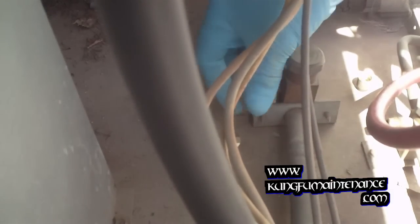Let's have a look at the low side here. Listening for any leaking there. We want to make sure — and actually I can hear the leak right there. That's where our leak's at, on the low side. Hear it there? Just pretty minor, but it's there.